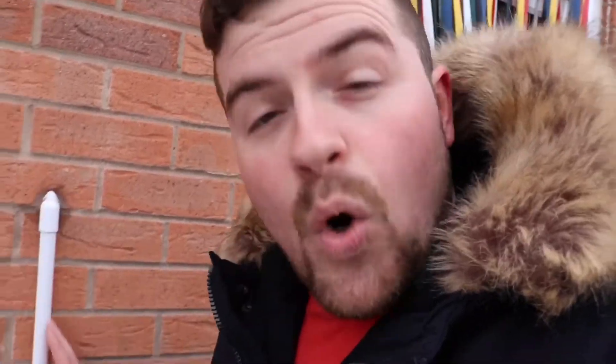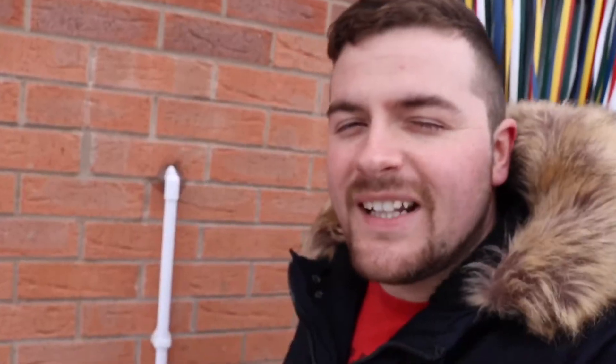So I'm going to quickly show you how to thaw this pipe out safely. What you're going to need is some hot or boiling water. You really need to keep on top of this pipe, because this pipe here is 21.5 millimeters — it's not very big, it's going to freeze very, very easily.